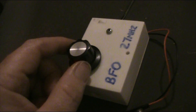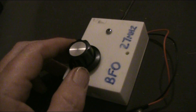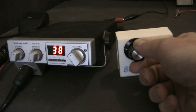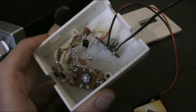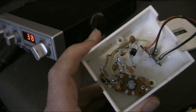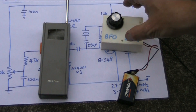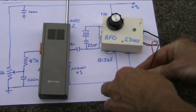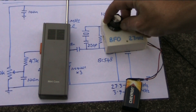There's a little bit of hand capacitance, so it would have been better if I'd used at least a shielded front panel and used the best capacitors available. The disc ceramics I used in this are not ideal. So that's our look at an RF oscillator that I've been able to use to receive SSB signals with an AM receiver, even if it's super-regen on 27MHz. Or failing that, if you've got something like a Nano VNA or some other RF oscillator, you could use that instead.